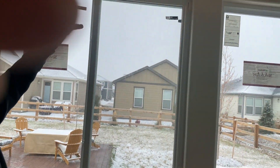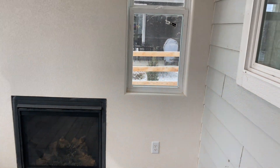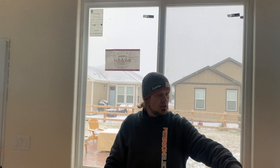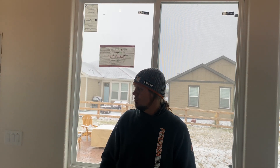I did do one sunroom about six years ago in Fort Collins that was completely glass. We had to use cement floor boxes and they had a monolithic pour. The inspector still expected us to have floor outlets even though we had no wood to put outlets on the wall. Of course, it's usually cheaper just to put in wood outlets and boxes like this.